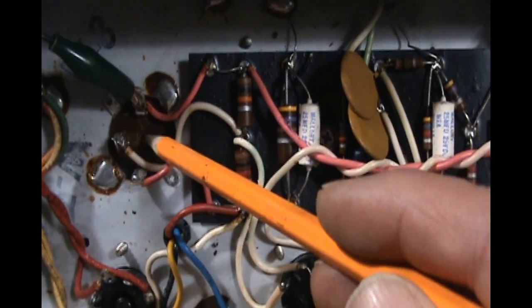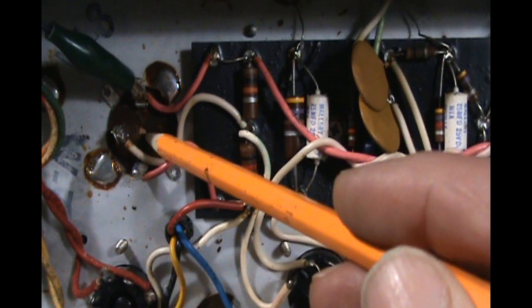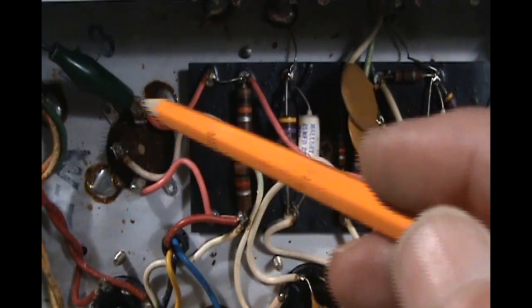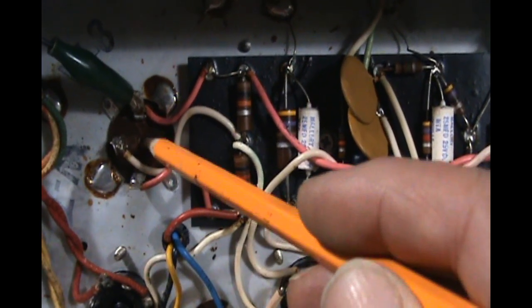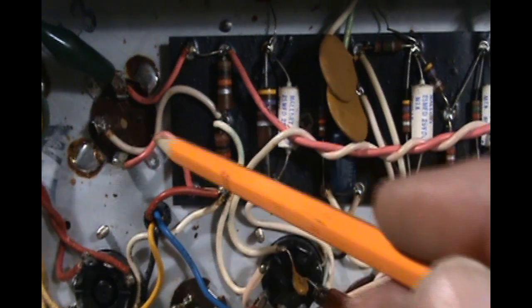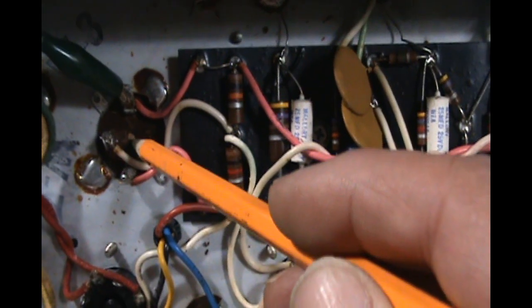We're going to replace the filter cap, which is three caps in a can at 450 volts. It's going on close to 50 years old, so we're going to put in 3 F&T caps, leave this can in place, just disconnect it, and put in 3 F&Ts to where the connections from this cap used to go, and they'll be 500 volt caps.